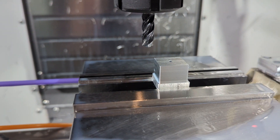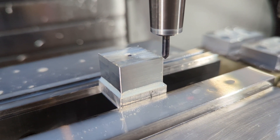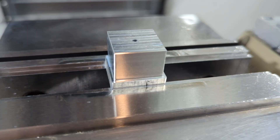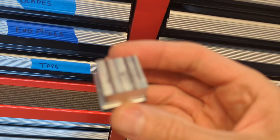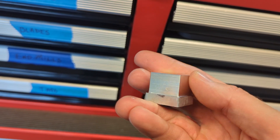If all goes well, you should end up with all four sides of your cube contoured. If things are going really well, you should be able to get your chamfer tool down into position without too much hassle. And if things are going great, you should end up with a part that has a clean machined top, beautifully contoured sides, and a chamfer that lays 10 thou onto all four top edges. Take it out, look at it, touch it. Notice everything you can — like this vertical line where my tool entered and exited the toolpath. Look at it under the microscope, examine the chamfers, the tooling marks, everything you can see. Take a moment to celebrate where you've gotten to. It really is challenging to get all these details just right — congrats on getting this far.